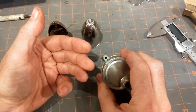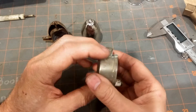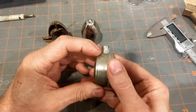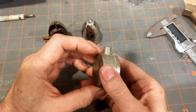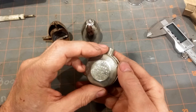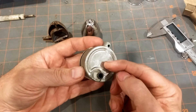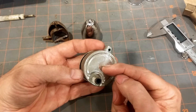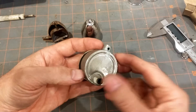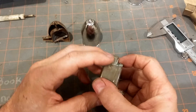The C, as you can see, has a huge vent, and the D is almost oversized. You'd typically put a D on a very large and hard-to-heat radiator to eliminate whether it's a venting problem or not. If you put this on a radiator and it still doesn't heat, then it's not a venting problem — there's something else preventing the steam from getting to the radiator.